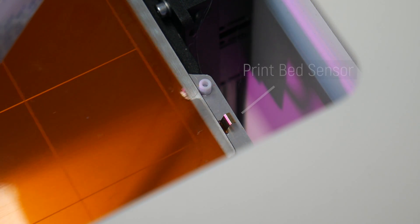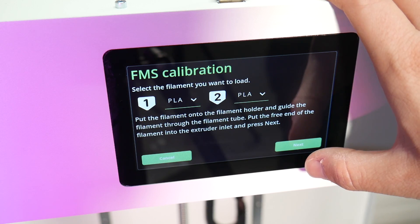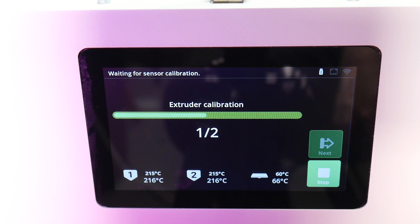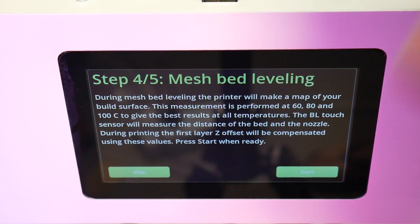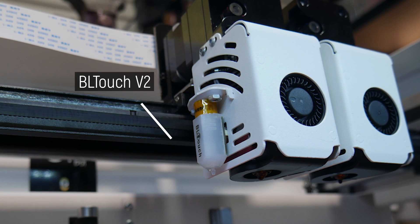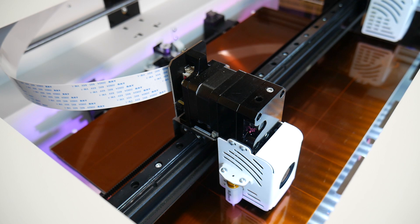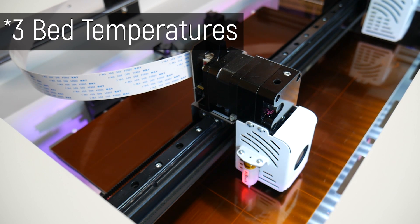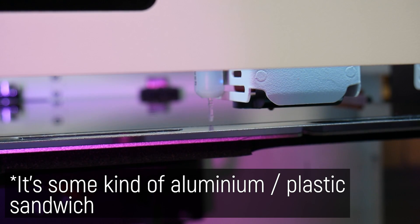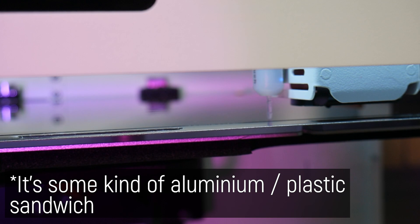This 3D printer is so jammed full of sensors that it offers the most automatic functionality I've literally ever seen in a 3D printer. Filament monitoring is done using an encoder — something we saw on the CraftBot 3 last year — but it's now integrated into the direct drive all-metal hotends. This means it knows if the filament jams, not just when it runs out. Mesh bed leveling is finally making an appearance on a CraftBot 3D printer, using a genuine BL Touch along with a complex automatic routine to sample several points across the bed at two discrete printing temperatures, which is important because this huge aluminum plate will expand enough to disrupt first layer heights between PLA and ABS printing temperatures without compensation.